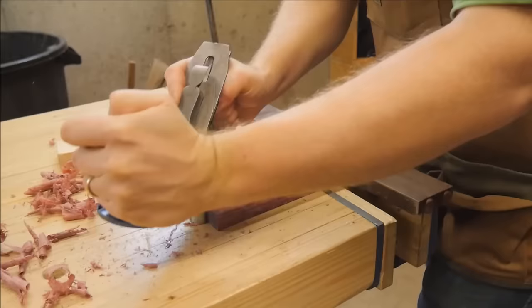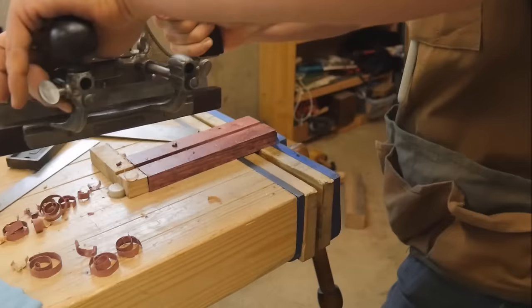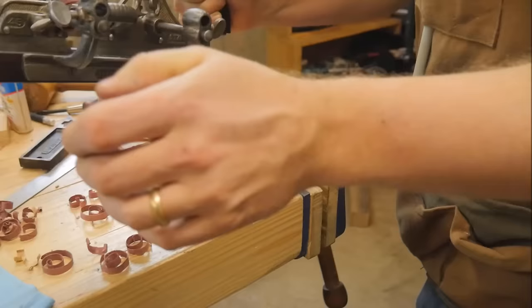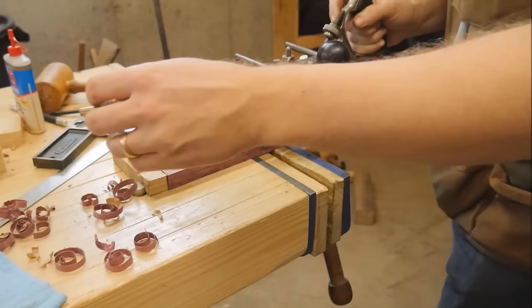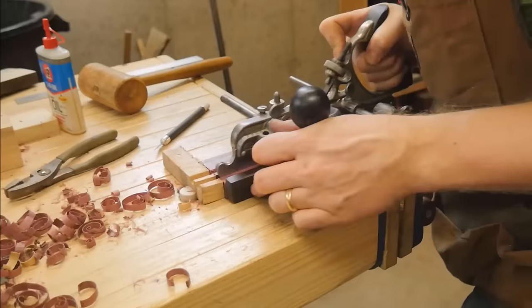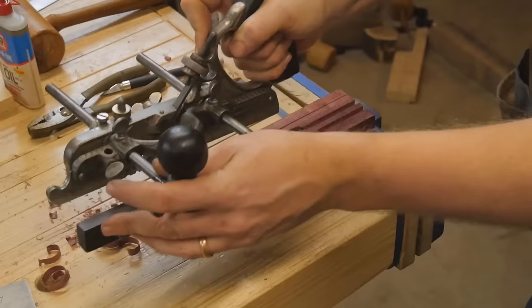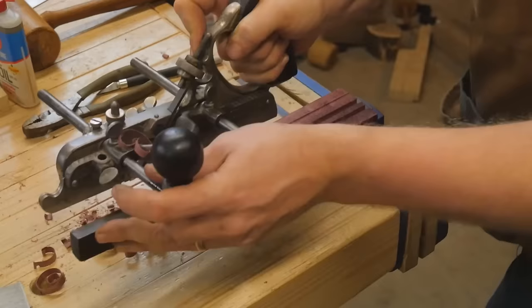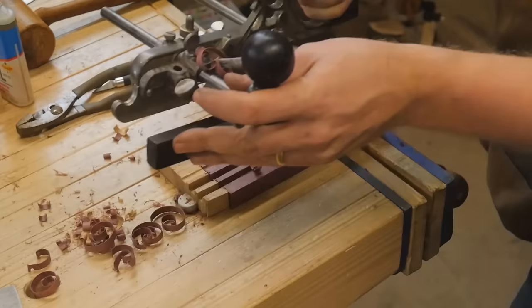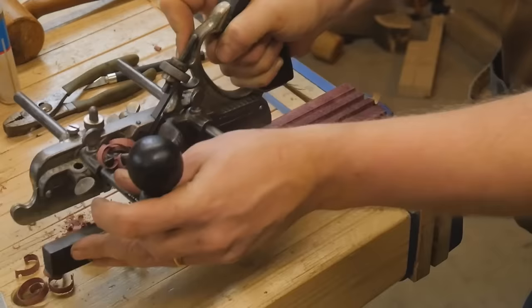I like to smooth out the two sides that will meet — the ash and purple heart — to make sure that they are perfectly smooth and perfectly flat. That will give me a good reference to go off of. Now we're going to start with the long grooves in the purple heart, and I make one groove a quarter inch wide, a quarter inch deep, right down the middle of the plank. The depth stop is set on this 45 very, very hard, because every cut I need to make has to be to the exact same depth, so as long as I use one depth stop for every cut, they should all match up. After the first groove, I'll cut a second groove a quarter inch away from the first one, and then a third groove a quarter inch on the other side, so I end up with three grooves that are a quarter inch deep, a quarter inch wide, and each of them a quarter inch apart. I'm being very, very careful to be exactly precise and making sure that all of these are precisely parallel to each other.